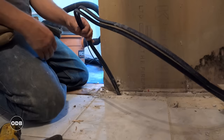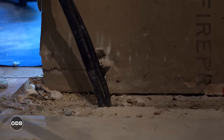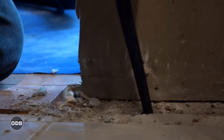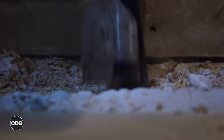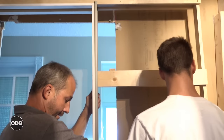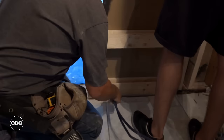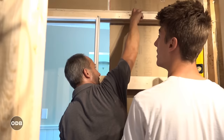The wire used to come up between the middle of the wood. Now there's a gap between the subfloor and the plate — big enough for my finger, which is big enough for the wire. We're going to move the wire into this gap so we can install the door and let the electrician deal with it later. Push the wires down, make sure they're not stapled to the underfloor, then drill a hole right next to the subfloor to verify the wire isn't pinched. I can see the wire is fine — pushed down, out of the way.